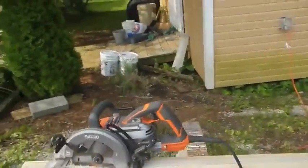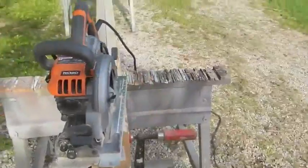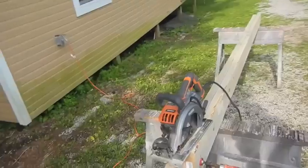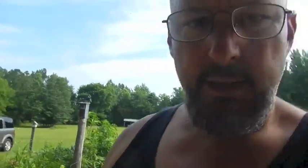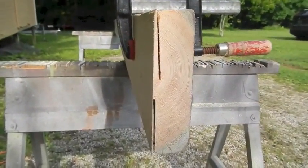I've got my scarf line — see it comes all the way back to here. I'm just cutting right down that line all the way across. I'll flip it over, transfer the line to the other side since I haven't done it yet — not a big deal. Make that cut on the other side, then take a Japanese handsaw because they're easy, and cut it all out. There's my scarf cut — awesome.